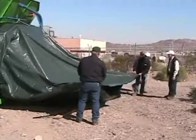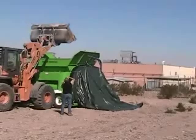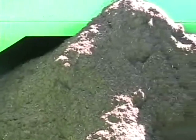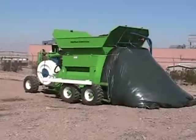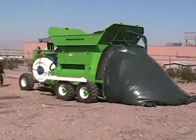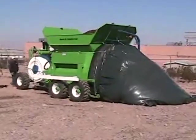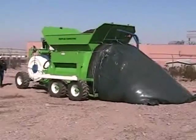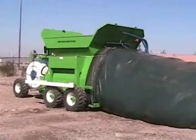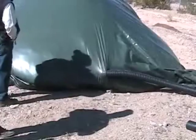The tube is unfolded initially by hand and the master seal is applied. The equipment size allows for loading by front end loader. When the hopper is filled, the operator remotely initiates the process. A sequence of events occurs beginning with the fill ram extending until the predetermined brake pressure is exceeded. At this point, the brake releases and the equipment moves forward, resulting in the tube being filled to capacity. A key component of the in-vessel composting system is the introduction and control of air, accomplished by opening the tube and attaching a blower through a flexible piping system.